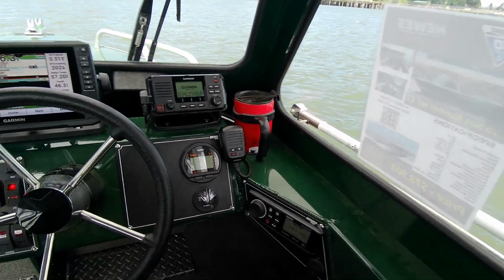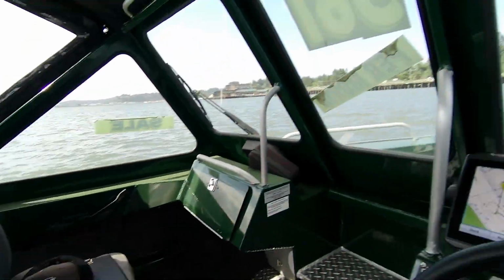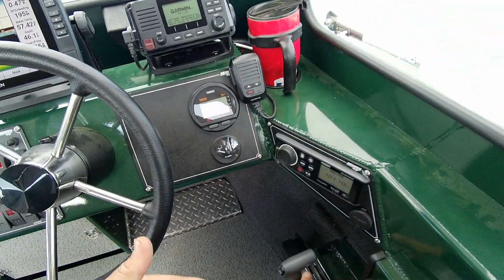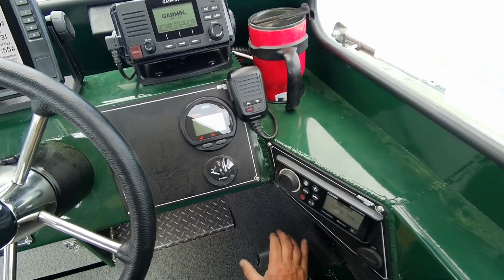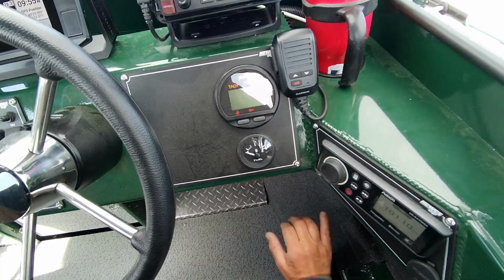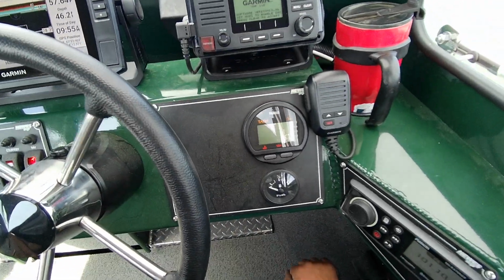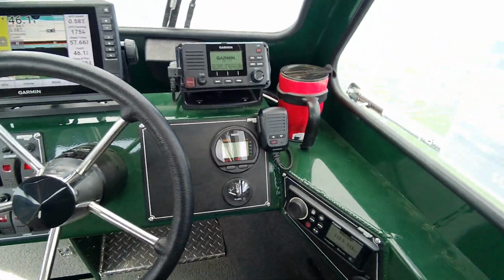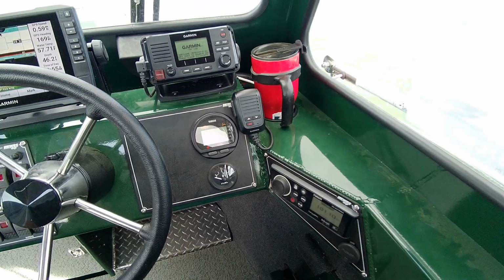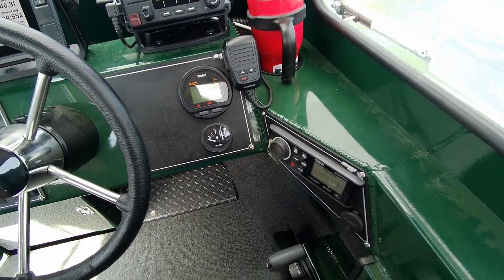So we're going to shut that off. Now starting this, I'm going to trim that kicker down. There, I heard it click. Now on the initial start, I had a guy ask me on this too. You want to lift up. Each one of these are different. So you want to go maybe 7 times to start with. Okay, full throttle back and forth, back and forth. Bring it back. Lift this lever until it stops. Then give it about 2 inches up. Then push in and turn the key.